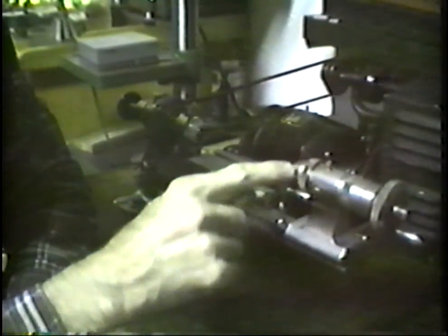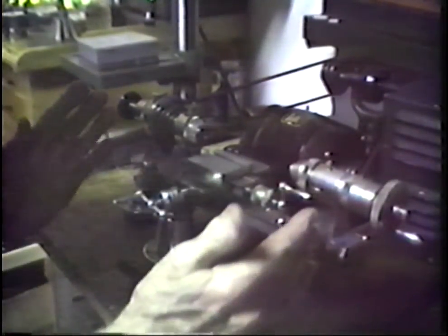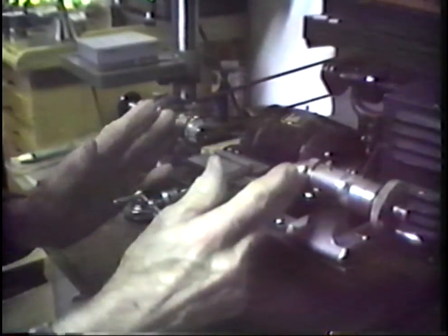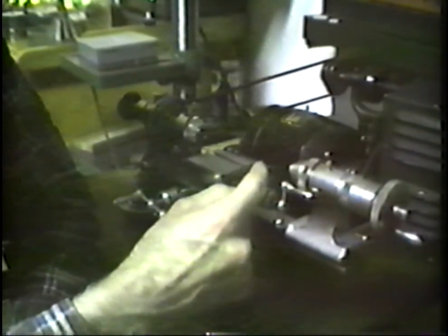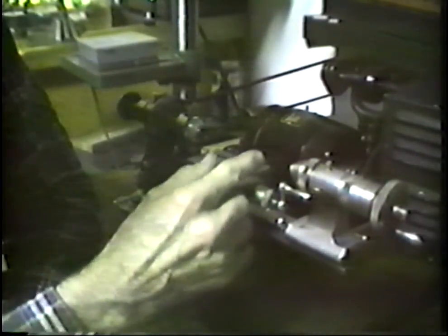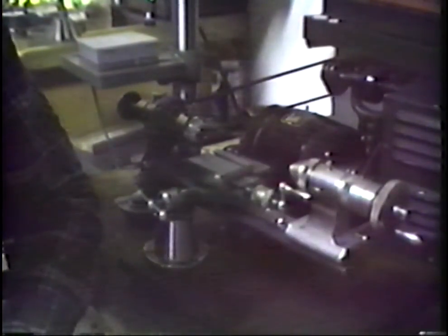These draw spindles will remove out of this tailstock, and we have in that dead center runners. We have a pair of spindles that we can put in here and run this as a dead center lathe as the English turns, which is the most accurate of all known lathes, has the highest accuracy capability. As we think a little further in this, we also have the hollow runners that go in here, and the pivoting attachments, that is the offset cup female centers that go in here, and the through drilling for pivoting.